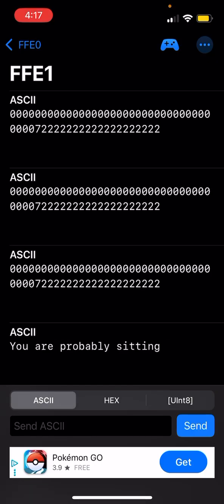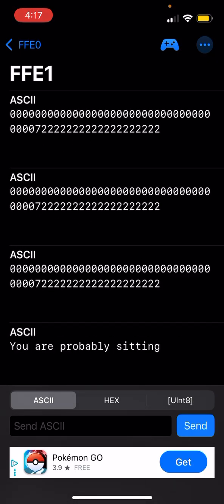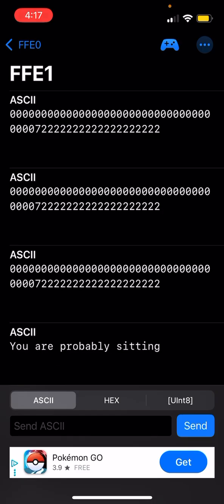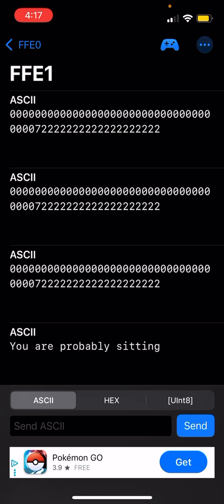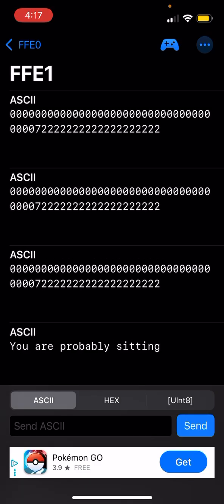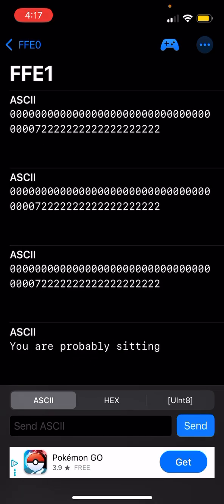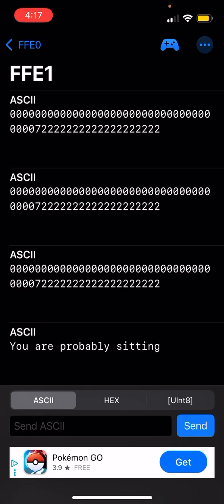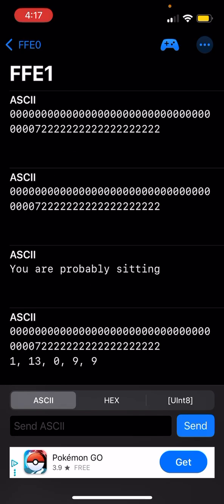Part of the reason that going upstairs and walking have high values for all zeros as input data is because I treated disconnects of the I2C as input. So when you're walking or going upstairs, the movement of wires tends to create disconnects. And I took that as input just because it shows up as movement. However, also when you're sitting, the lack of movement causes the delta values to approach 0 as well, which would make sitting in this case a better option than walking or going upstairs.